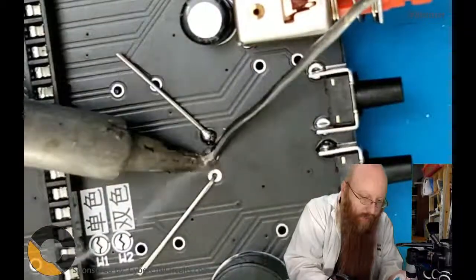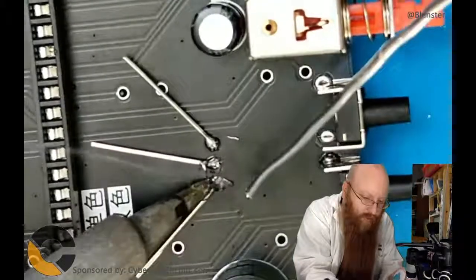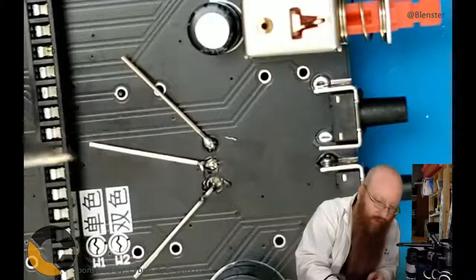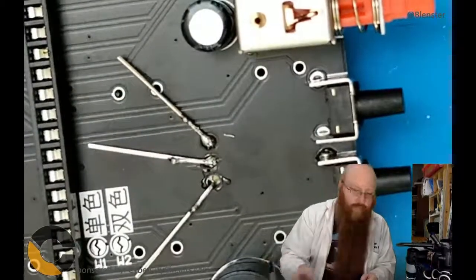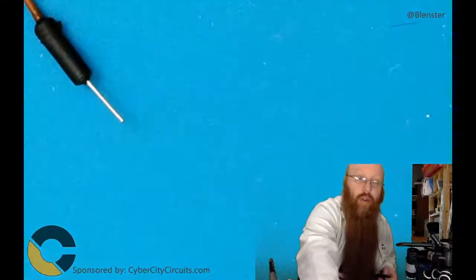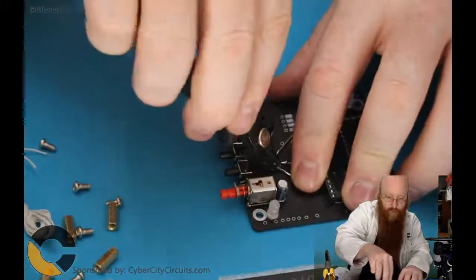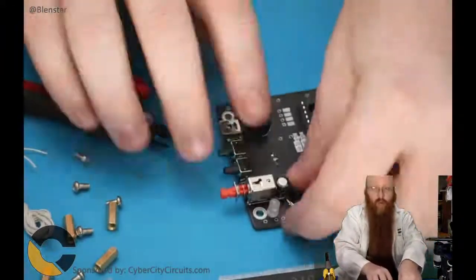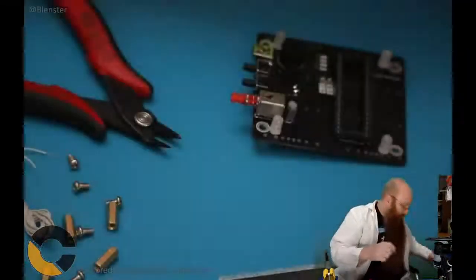and just pop them in place. Now the PCB is rocking a little bit. That happens when it becomes uneven. And it's a good time to remind you that you want to use very little pressure when you're using the soldering iron. You don't need any pressure. If you're putting a lot of pressure on, you're going to have a hard time. It's just going to be not fun for you. So let's trim these.